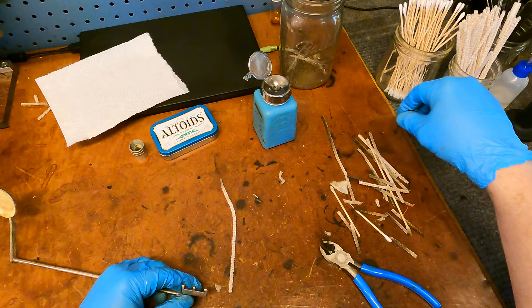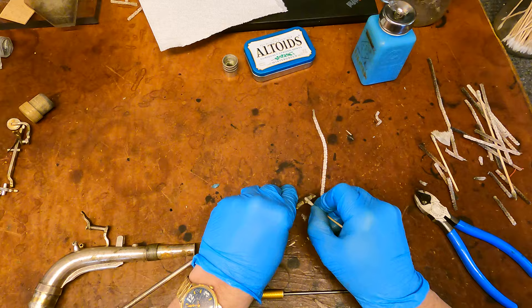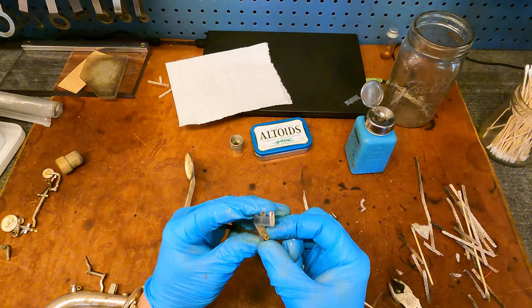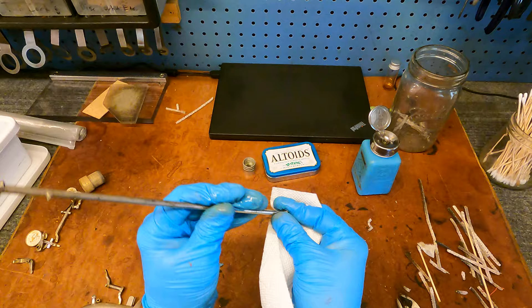Some of these pivot receivers are way deeper than others, so I'm going to have to look out for variations and keep an eye on where my pivot screws are. I might have to do some key fitting, and if I find one that's really loose I wouldn't be surprised if I had to do a bushing and pivot screw receiver — I've got a video on that. Hopefully not, but we'll see.